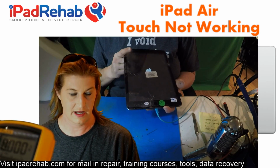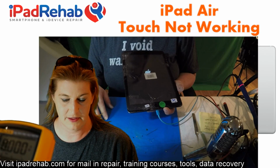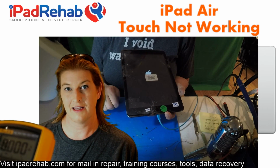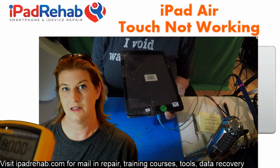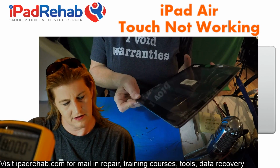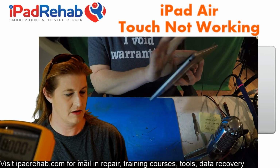If we don't have touch, then we really have no choice but to go explore underneath the shield that covers the Cumulus chips and try to figure out what was making this voltage not be present from the PMIC. Apparently it doesn't matter if the PMIC puts it out or not. Let's see if I can slide to power off. Slide to power off. Nope. No touch. Wah, wah, wah.